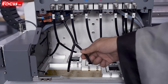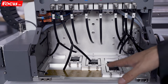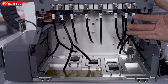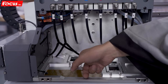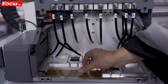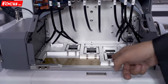On a brand new machine, the print heads are not installed because if the machine is delivered with rough handling, it is easy to damage the print head. The print head is the main core and most expensive spare part for the machine. For safety we deliver the print heads in original packaging, and once you get the machine you need to install them. Inside we can see there are totally three print head installation adapter boards — all with screw locks ready. To install a print head, take out the adapter board, install the print head, and install the print head with adapter board to the bottom board.